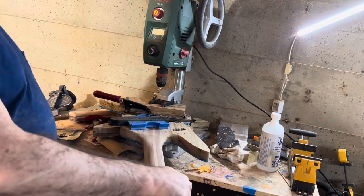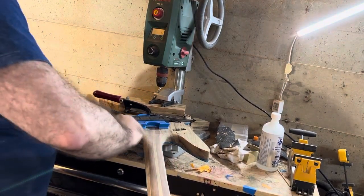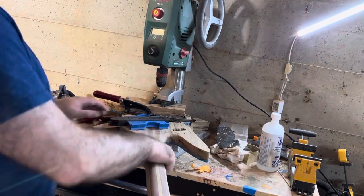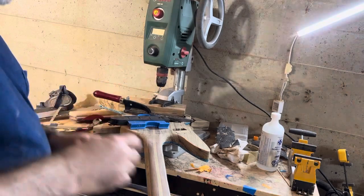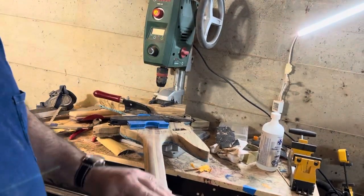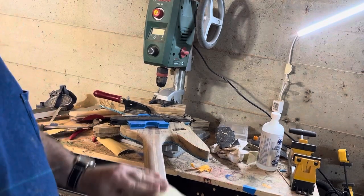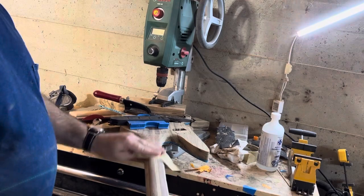It doesn't have to be like that. It can be skinny down here, especially with this neck-through. You can make a nice heel like this with a set neck or a neck-through so that there's no heel whatsoever. And I feel good enough about this to give it a shot at 150 and call it. Oh yeah, that feels good.